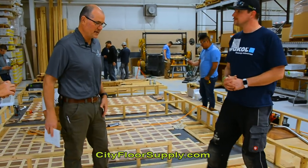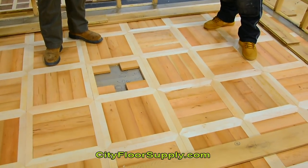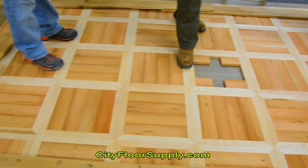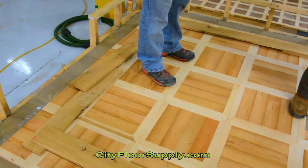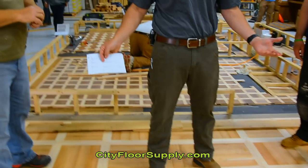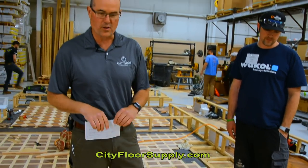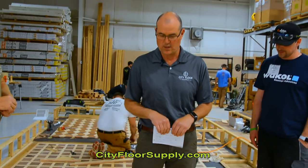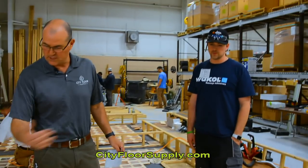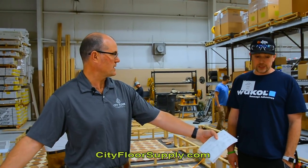It's a beautiful pattern. The field is pretty much done, and they're going to work on the borders — all the borders have been squared off. One of the best saws to use to square up after the field is laid for border work is the Festool track saw, the TS 55 with the vacuum — it really does square things up. They used a custom 10-foot track, putting two together with a shorter one to fit their 12-by-8-foot panel.